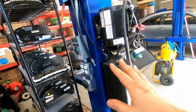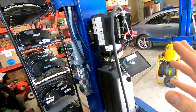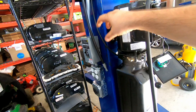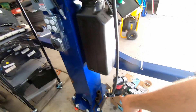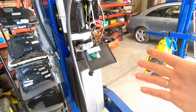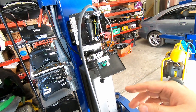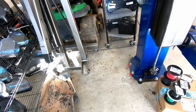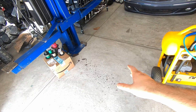I was checking everything, making sure I have 240 here and that all works good. I knew this container was pretty much empty, but I expected maybe some residual fluid — a couple of drops. So I put a paper towel here, connected the 240 outlet, and pressed the button for maybe half a second or less. I was expecting any residual fluid to just spill onto the paper towel — but the paper towel flew away and everything was covered in hydraulic fluid. You can see the mess even on the tractor. So it was literally less than half a second and I can confirm the motor is running and throwing fluid.